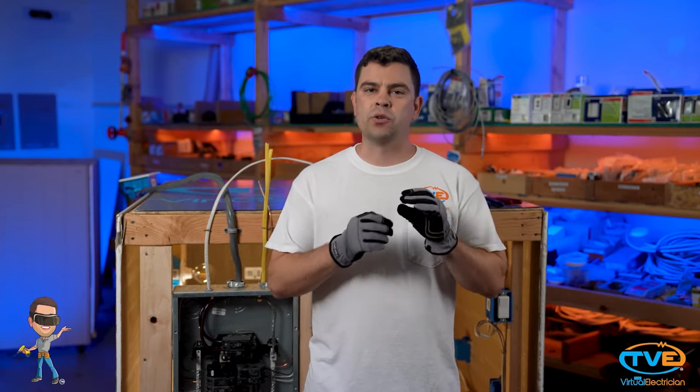If you plug one of these things in and the outlet does stop working, turn the breaker off — if it didn't already trip — and inspect that outlet. You may find out that the wire has been stabbed into the back of the outlet. This is bad. Over time, these wires loosen up and when you plug a heavy load into it, you burn up the wire.